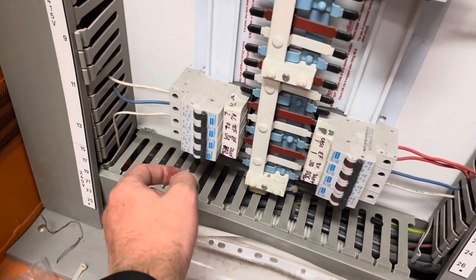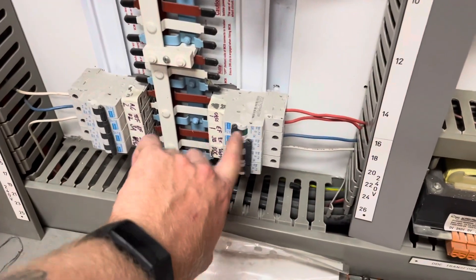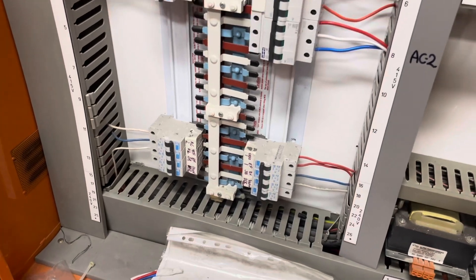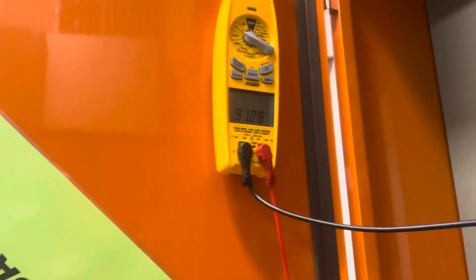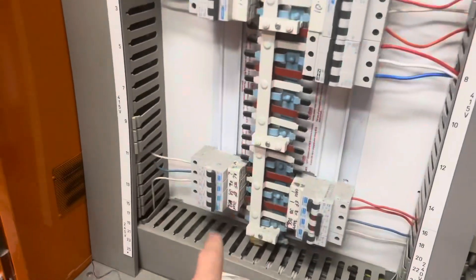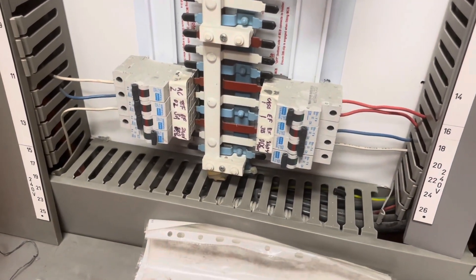We're running out of circuit breakers here. There we go — lucky last. We're going to pull this one out, work out exactly what that does, and go from there. I was individually going back up and turning them on. I've hit this one back on and I'm getting some reading, so I'll leave that one off. All circuit breakers except for these two and this one are on, because those three are giving me a reading. Now I'm going to work out exactly what they do.